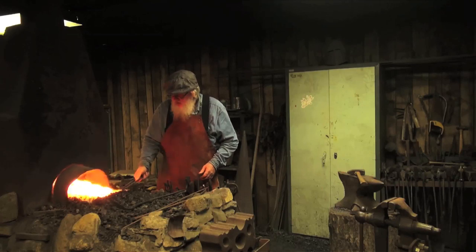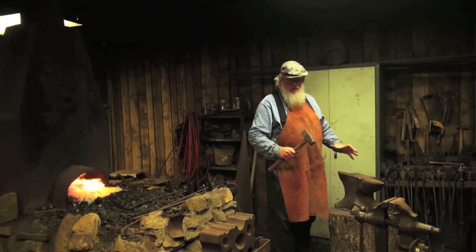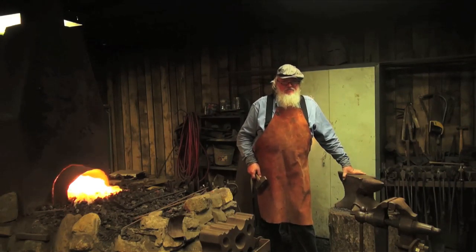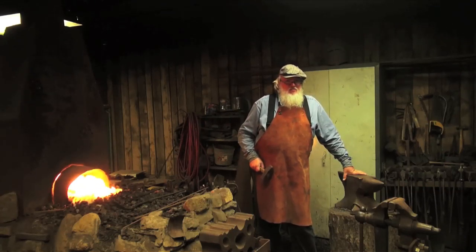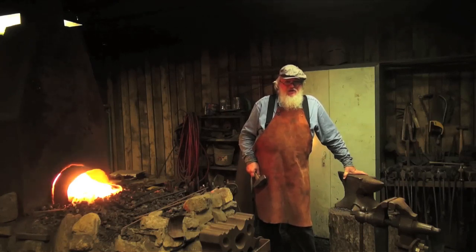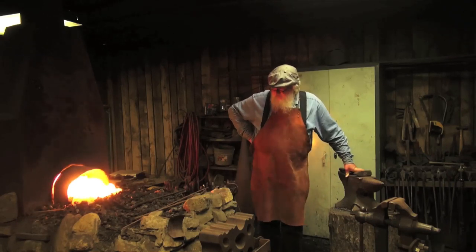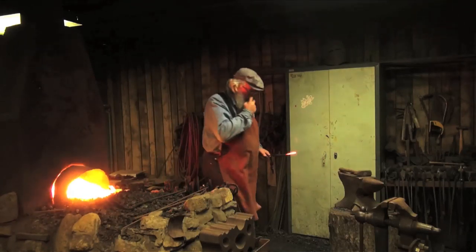Just a word about anvils. The way to test an anvil when you're going to buy one is take a hammer with you and make sure it's sitting on the floor or on something fairly solid where you can drop your hammer. See how far it bounces back — that's what we refer to as the life of the anvil. An anvil where the hammer just lands and absorbs the blow, or if it has a really dull ring, there's probably a problem with that anvil — like a crack somewhere that you might not see, or else it's mostly cast iron, which is not desirable. There are a lot of cast iron anvils out there but they're really what people in the craft refer to as ASOs — anvil shaped objects — they're really not meant to be worked on. This anvil, the best I can tell, is a Foster, which was made about 1840. It's a double horn, which is handy for a lot of different processes.